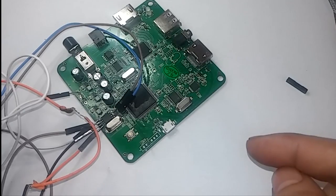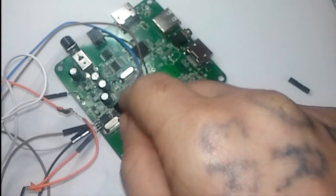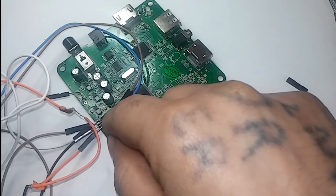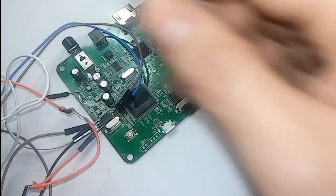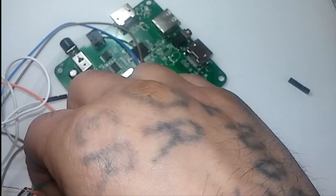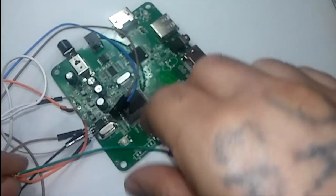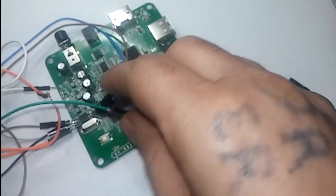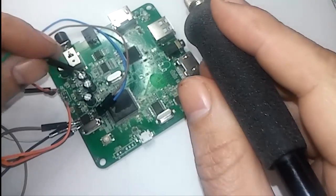And after the ground, I'm just going to show you guys where to hook up the WP pin as well. So with the W25 chip, just count 3 from that dot side. So it's 1, 2, 3, 4. And it'd be the 3rd pin there. So I'm just going to attach another one, and this one's going to also get connected right to 5 volts. So I'll just twist it on. Put the rest of them over here. Solder that part after. And try to see if I can carefully get this pin in there, which is kind of crowded now.